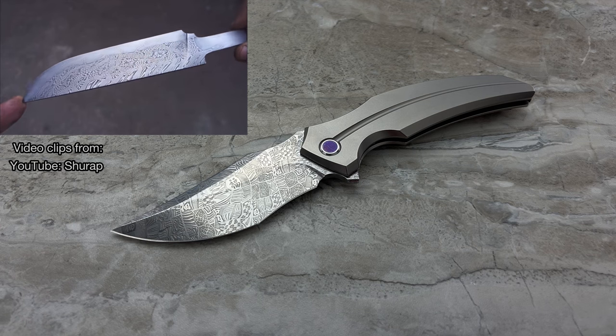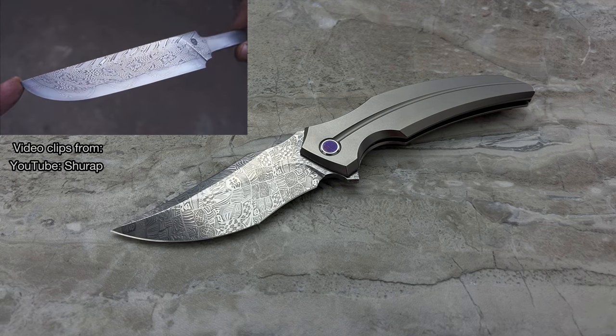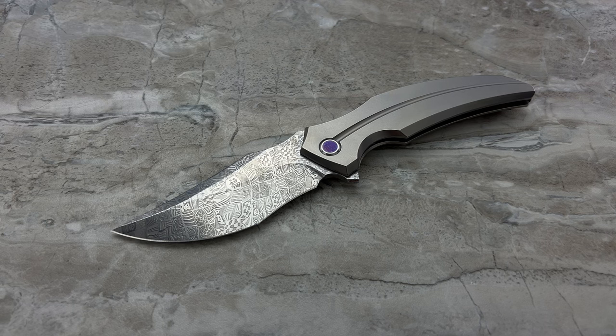And you're going to very carefully set where you want that pattern to run in the blade. When you forge it down, you cut it down, you center it or you decenter it, wherever you're going to put it, down the length of the blade to create the pattern you want. Especially after you've ground it, you're going to have a certain look that you want. Maybe you only want that pattern on the bevels, or you want the pattern to disappear down the bevel. You want the pattern only to be in the flats area. So you know what you're grinding, you know where you're going to set it, and you get to create that. But most are going to be very repetitive patterns like this or something similar, where the whole knife is going to have that pattern.